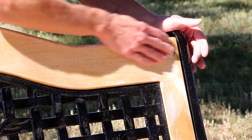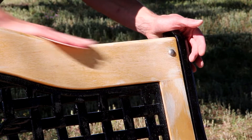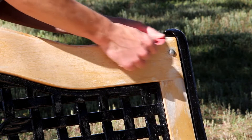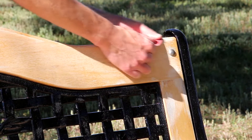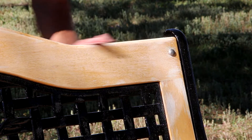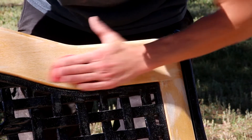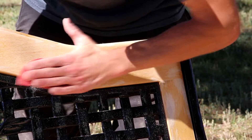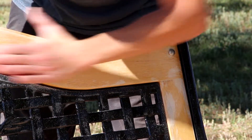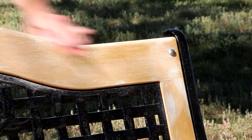It's almost inevitable that there's going to be some hand sanding involved. Now, based on my experience maintaining a finish like this, it seems like as it wears year after year and you sand it down and refinish it, the worn spots still seem to be a little bit visible. The best way I've seen to make all of these spots blend in is to really do a full restoration — sand all of the pieces down to bare wood and recoat evenly from there. Otherwise, you can still see the worn spots over the other areas of the wood.